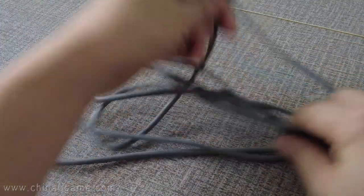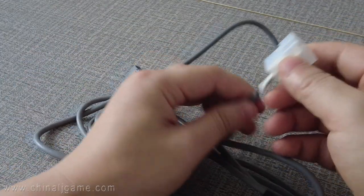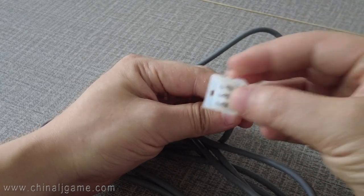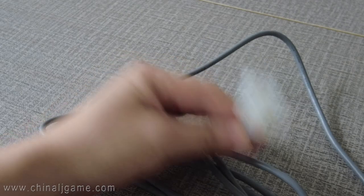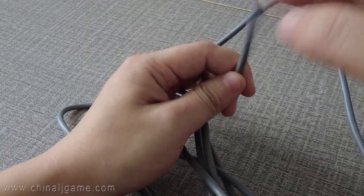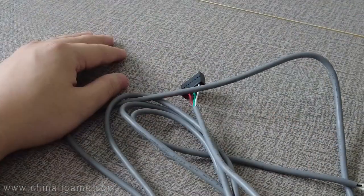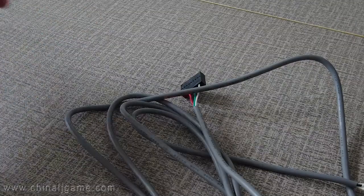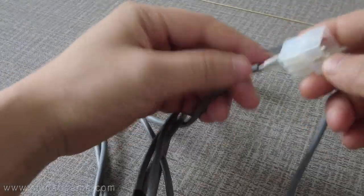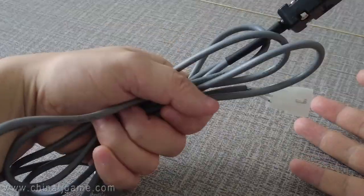Previously, we sent some cables to the United States but we had not added the connectors for the bill acceptor. The three wires — one for 5V, one for 12V, and one for ground — you can find matching connectors on your existing power supply, because there are always extra interfaces on the plug power supply. You can cut one of them, connect it to the cable, use tape to make it stable, and then it's complete and working.